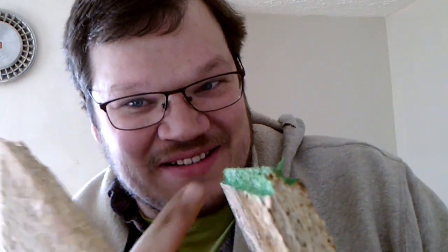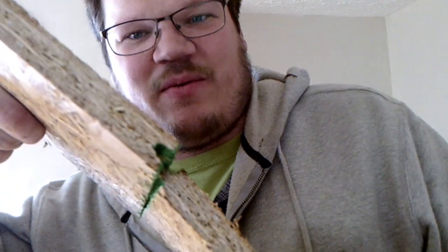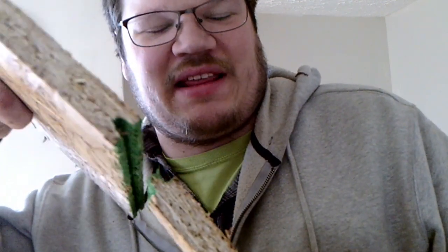This here is what they call a tongue, and hence a groove — tongue and groove. The tongue slides into the groove to make one section so they won't flip flop around as you walk on it. If you opt to not get tongue and groove, make sure you at least use clips — metal clips that interlock the two pieces. Or you can simply put a 2x4 between the joists as blocking. But the tongue and groove is much easier, so let's go that route.